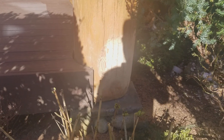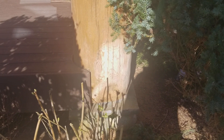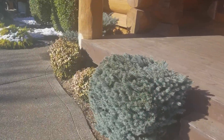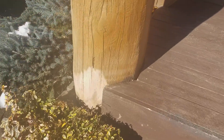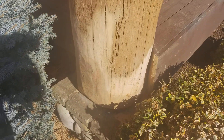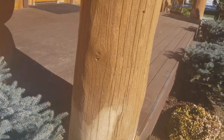And then we would incorporate some Cobra rods, which is a borate time capsule to prevent further damage. We had the same condition over here on this log post — the decking built too tight. We had to cut that decking back a little bit to give these log posts a chance to dry out when things get wet, and grind that back and so forth.